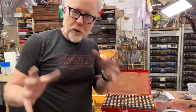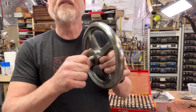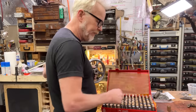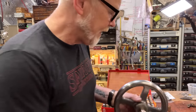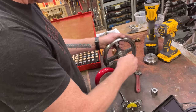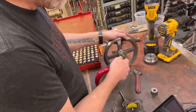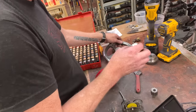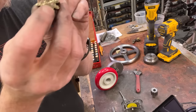Once again, you can't just go by measuring gauges for stuff like that. So I found the pin gauge that's the go-no-go gauge for this, and I machined this down to about 1.5 thou over that. When I join these together, I'm just trying to hold these in orientation. See, the small one to the big to the small, and that goes in there. Then I can hold on to that to drill through it and clean the other side. I'm gonna chuck this in and clean that up a little bit. Well, it's already got a set hole, doesn't it? Yeah. Right.